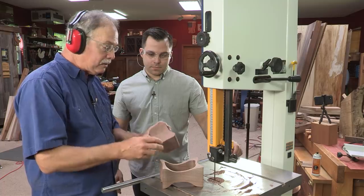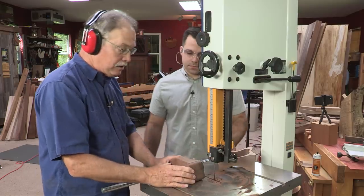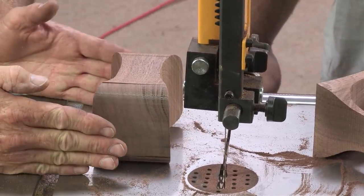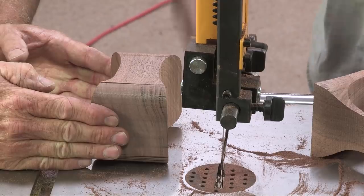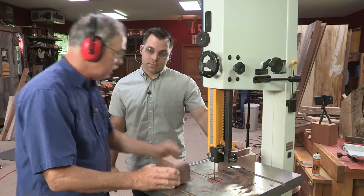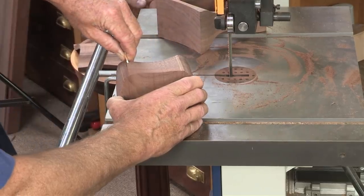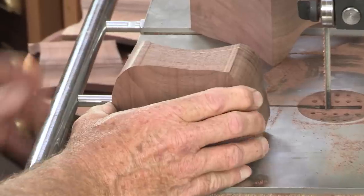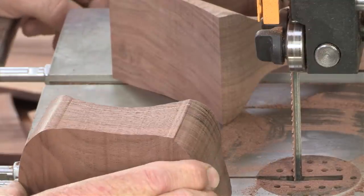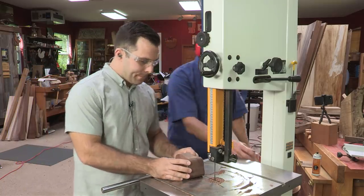Now, the next thing we're going to do is take the most stable piece of this top, put it down to the table — it's flat, not rocking. If it were not flat, you'd use wooden hand screw clamps, open them up, clamp it down — that becomes your jig. But this is secure, and you make a thin cut right here for the locking tab. I want you to carefully take that little sliver off, keeping your hands well away from the blade. I'll fire it up and we'll get this done, then it's on to the glue-up.